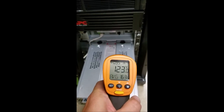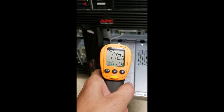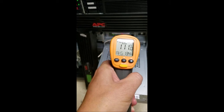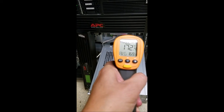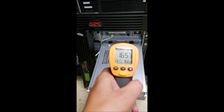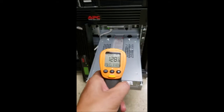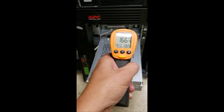Yeah, that's pretty bad — could have gotten really nasty. This has probably been going on over a couple of days, but the generator test is what caused it to go under load, and that's what caused the batteries to overheat this much.